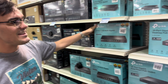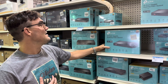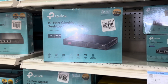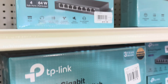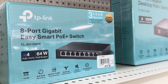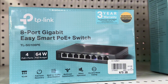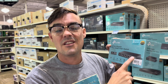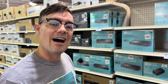Right here is a 10-port gigabit PoE+ network switch for $80 — pretty affordable. This is going to allow you to plug in additional devices to your router. Your internet service provider gives you internet, and this allows you to power the cameras and the joystick. We've got four PoE ports that will power both cameras and the joystick, plus five additional ports to connect to your laptop and other IP devices — maybe a wireless access point. Let's add this to the cart.